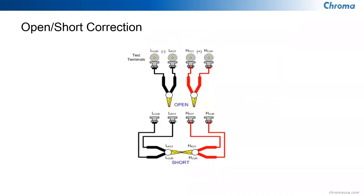Another critical technique is open/short circuit correction, which we have on all our LCR meters. We show the LCR meter what infinite impedance is and what zero impedance is, giving it a reference — almost like zeroing a scale before you stand on it. When the test leads are open, the residual admittance Y is measured. When shorted, the residual impedance is measured. When the device is measured, these two residuals are used to calculate the actual impedance of the device under test.